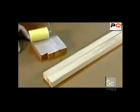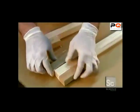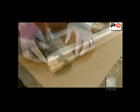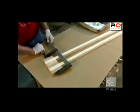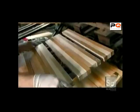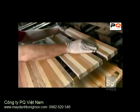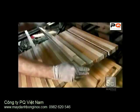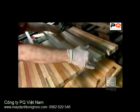Over at another station, workers are creating the paddle shafts, 2 at a time. They glue shorter pieces of wood for the handles and clamp them together to allow the glue to set. The blade chunks are arranged in a much bigger clamp. Then the glue-coated ends of some shafts are wedged between the blade pieces.